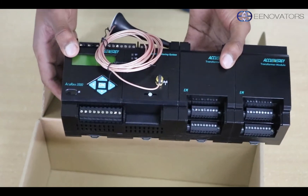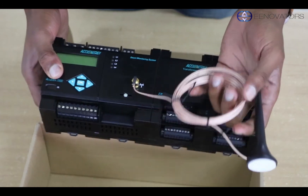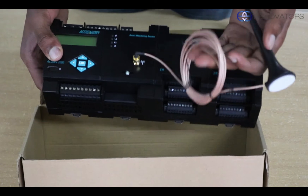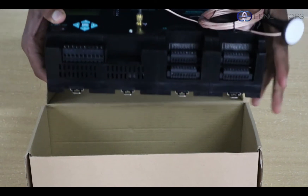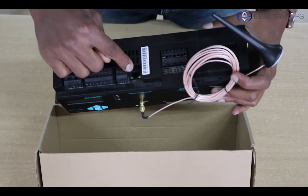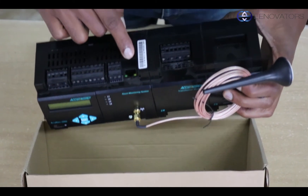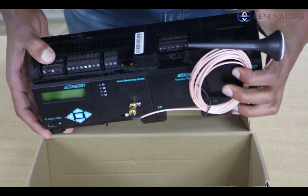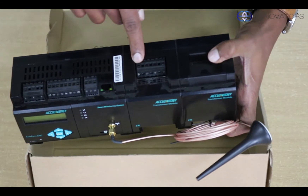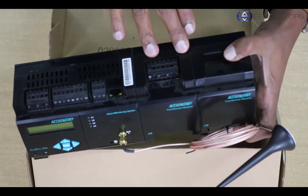It's a great product for tenant metering because of its features. There's a wireless antenna for accessing Wi-Fi. The meter also supports Ethernet communication through this port, and there is a provision through the same port for Modbus TCP. Looking across, you can see there's a provision for voltage inputs. This is what you'd connect to your main supply or power distribution unit.